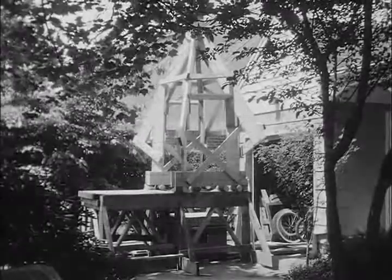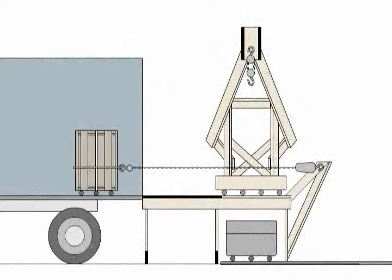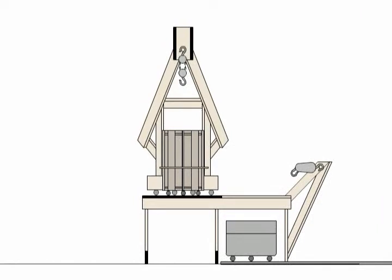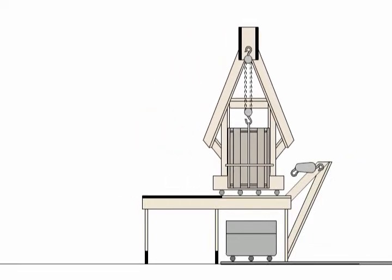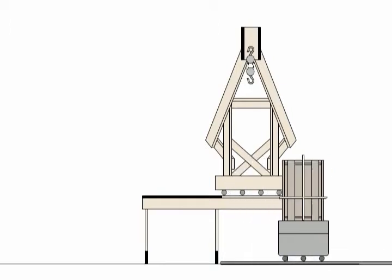The wood is assembled in the driveway of the sculptor's studio in a residential neighborhood. The plan is to move the block off the delivery truck on pipe rollers, then remove the rollers using a hoist mounted on a gantry. The gantry, which straddles the block, also moves on rollers. The block is brought to an opening in the back of the dock and lowered to a work table. For carving purposes, the table needs to be less than the four-foot height of the dock. The table and block are then rolled into the studio.